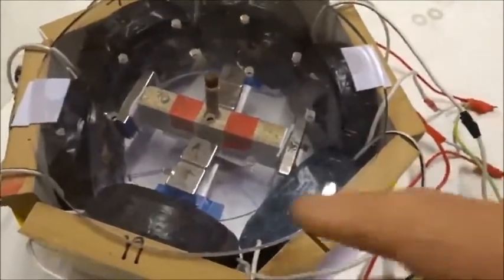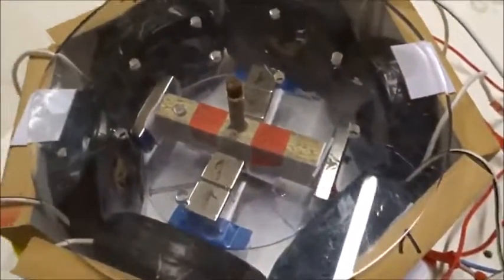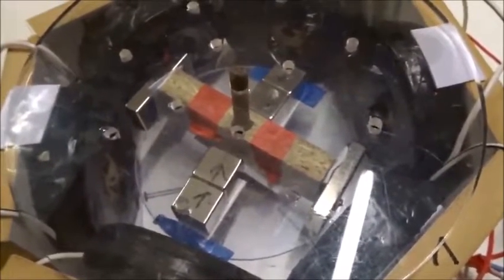This rotor with 6 wire coils vertical and a row of magnets, both south poles out here and both north poles out here, will start quite easily, even at 10 hertz. Start from 0 to 10 hertz instantly. The torque's really very strong. Watch me when I turn on the power. Now let's start it at 20 hertz. The full power is 50 out of a power supply.